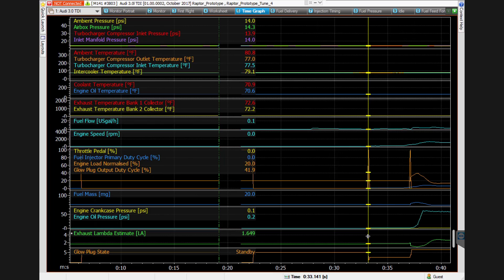It may power on the glow plugs for a split second, but then it goes off and just goes into normal crank. You can see from while I was cranking — that's at just over the 33-second mark. I stopped cranking at the 37-second mark, so four seconds of cranking is when it fired. It fired at 464 RPM and went up to 1270 RPM, then came back down to idle at 1000 RPM. That was a really nice clean start. It took a little bit longer — that was completely cold for the day — but it's not wasting any energy now with the glow plugs. They're only on during the preheat stage.